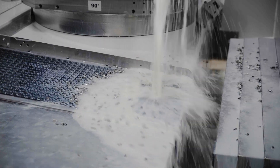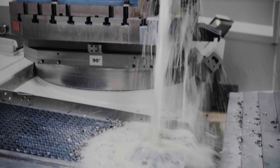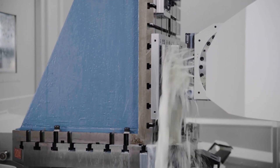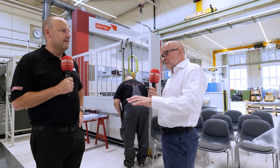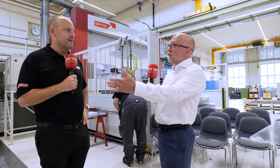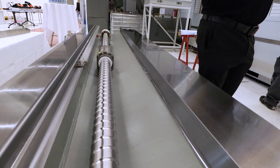That will sure improve your tool life. Hydrostatics have advanced significantly — there used to be a big speed advantage for linear guideways, but not today. This machine is as fast as its linear guide rail sister in the range. There's no detriment to performance when the machines move into tool change or rapid traverse — there are massive improvements in cutting capability.